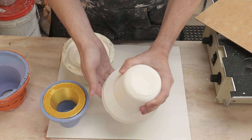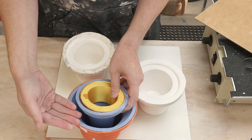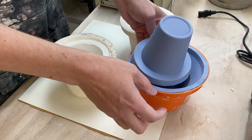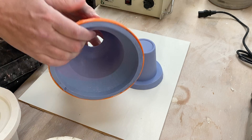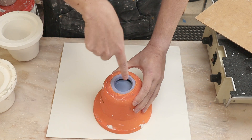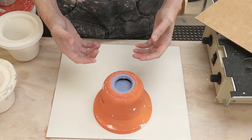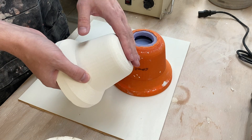I want to cast it like this. Here is my outside sleeve for the silicone and here's the inside — these two go together. I pour the plaster in here and the bubbles are rising to the top and I was catching them. What I want to do is turn this upside down so the bubbles come around. So I made some slight modifications to my mold. The inside piece is exactly the same. I'm going to secure it down, then invert the outer piece — you'll notice a big gaping hole I cut in. I'll center this over the top, secure it down, and the plaster will go in here. As the bubbles rise they now have a place to go and escape. Hopefully they'll all come out, but if the few that don't get stuck they will be in the bottom of my mold which doesn't matter as much. That is the new theory — let's try it out and see if it works.